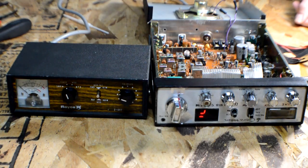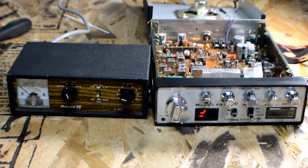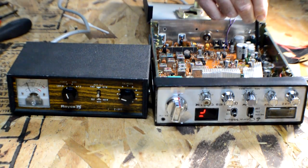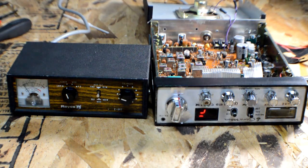Now we're going to show you how to tune up the inside of the radio. I got this radio set on AM right now. What I'm going to do is key the microphone and then you can look at the meter. You can see we have about two and a half or three watts, and we're going to make that go up a little bit. I'm going to put this in here to VR10 and key it again. While I got it keyed, I'm going to turn and you'll see the watts just kind of climbing right on up toward the end of the scale. And we have AM set.